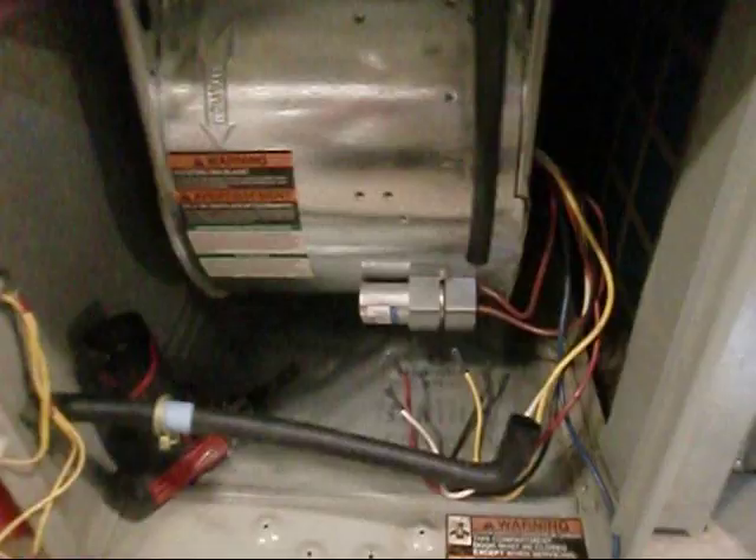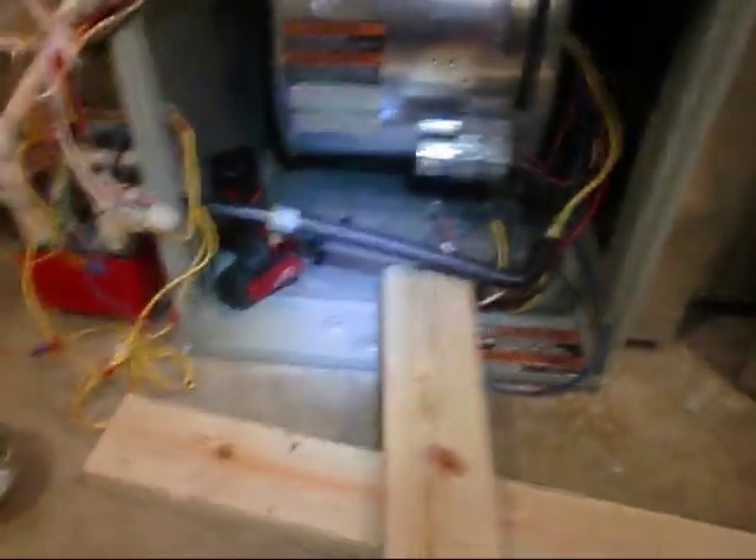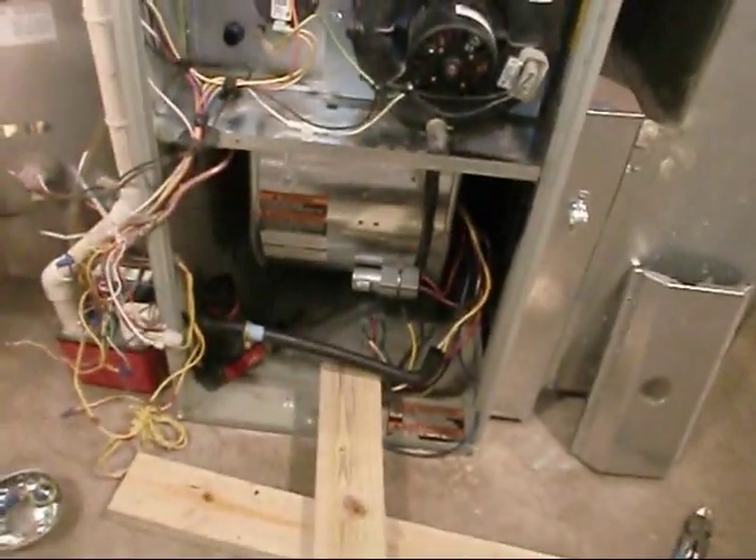We successfully got her back in there — clean, brand new clean blower motor. I had to do a little maneuvering to get it to go back in there so I can get my screws back in it, but we adapt and overcome. Got our board here — I wanted to get a good close-up on it. Here's your thermostat wires, here's your transformer, here's your high voltage side, low voltage side, here's your hot coming in off the board. Right here is where your hot comes in off the door switch, which is the first thing that gets fed to the appliance. And here's your cool terminal, your heat terminal, and your park terminal.